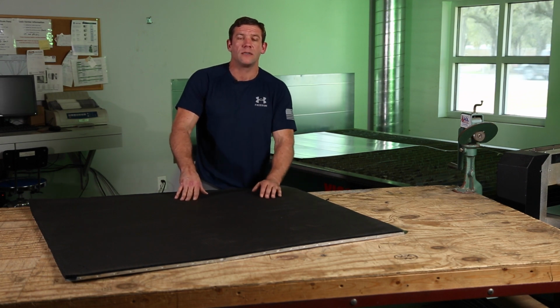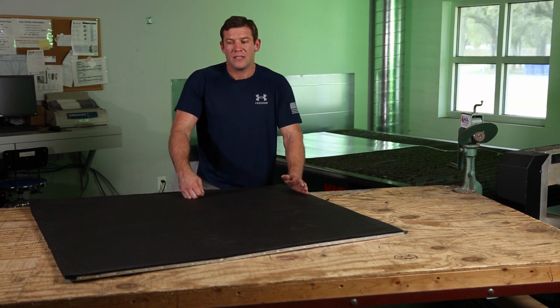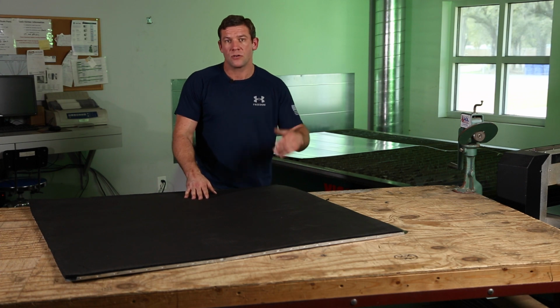Coil Flex is a product that Armaflex sells that allows compression in a brake. When you get up to 2 inch or something, you probably can't do internal lining anymore because you'd have to do it in 4 pieces. That's normally where you'd go externally lined.